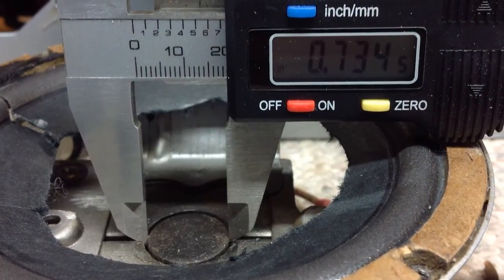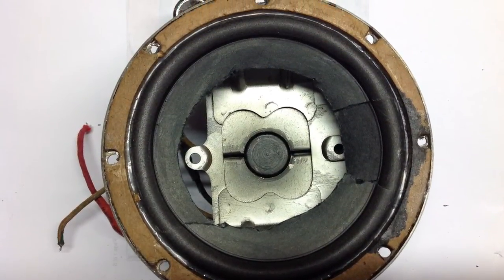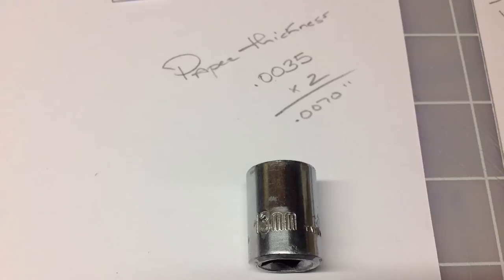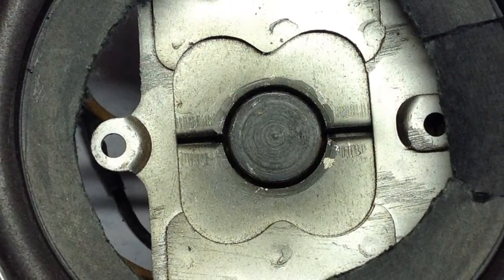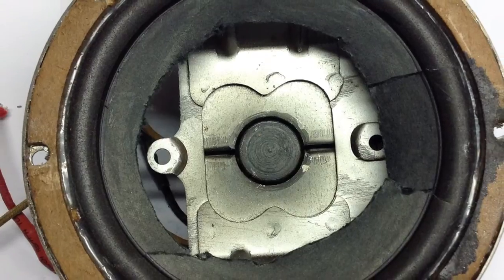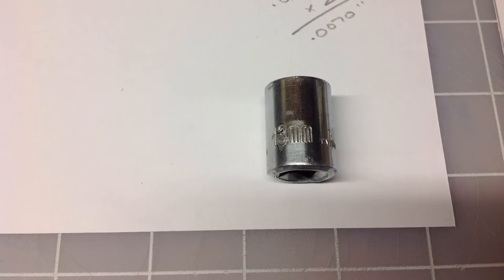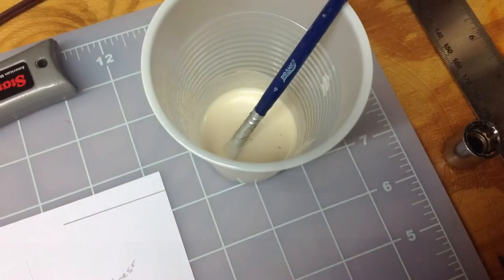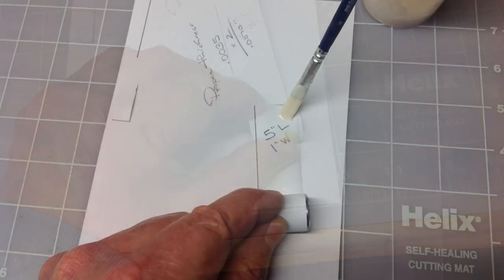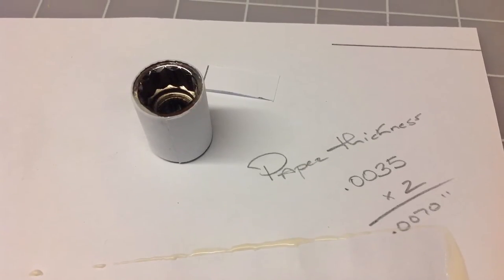I had already measured the center pole piece of the speaker and knew that my voice coil diameter needed to be 0.75 inches or just a shade larger. Looking through my toolbox, I found the perfect former: a 13 millimeter socket one inch long. By measuring the gap between the center pole piece and the frame, I knew I had just north of three one-hundredths of an inch to work with in total. Here I am making the coil former using the 13 millimeter socket, paper, and glue — which is four parts wood glue, one part water, two parts alcohol. The alcohol really makes it dry quickly, removes any wrinkles, and the paper provides a nice symmetrical form that's very slick.